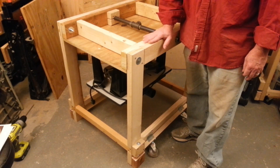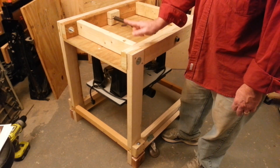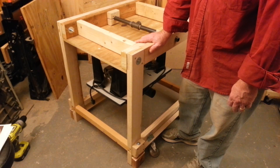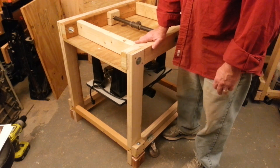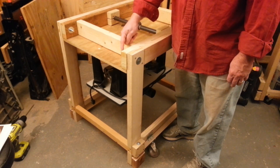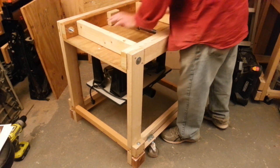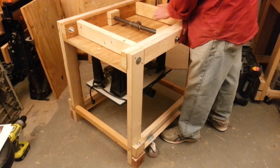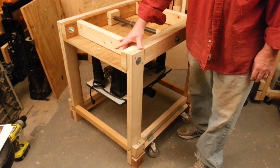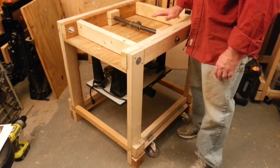When initially designing the flip-top table, I spent a lot of time thinking about different ways to lock the rotating table to the frame. I saw many approaches from YouTube builders, but in the end I took the easy way out: I'm just using 3/8-inch bolts with fender washers on each side and a nut in all four corners. When the bolts are tight, the table simply doesn't move — it's rock solid. It's not the most convenient to remove all four bolts to flip the table, but once everything is tightened back up, you can be very confident nothing is going to move.